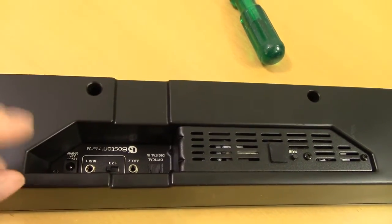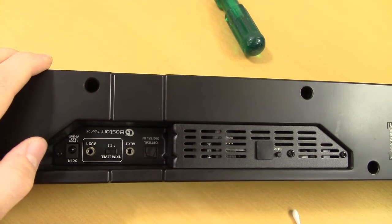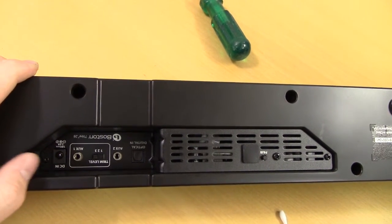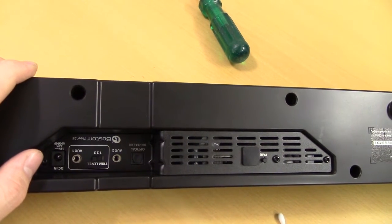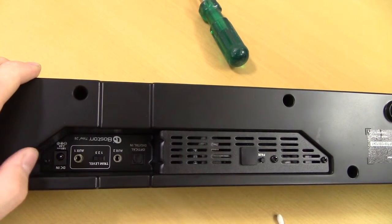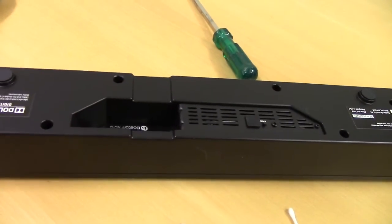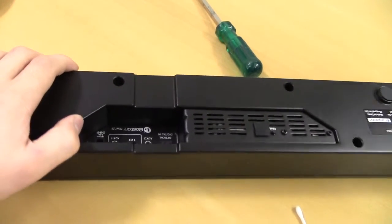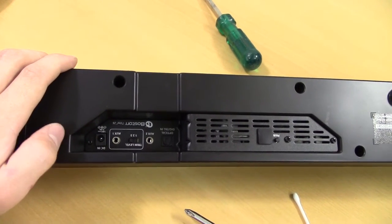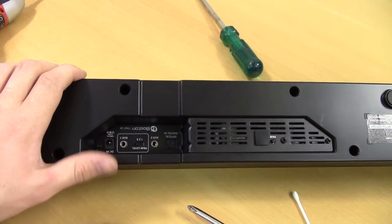Alright, I did some searching around, and it seems this thing actually has some fairly fancy switching voltage regulators in it. In particular, a Texas Instruments LM40-something, which should handle up to almost 30 volts of input. So I'm fairly confident to just hook this thing up to a laptop power supply and see if it makes any difference. I also put some isopropyl alcohol on the ribbon connector for the front panel, since that one seemed to be a bit oxidized when I took it out. So who knows, it might not even have terribly bad caps. I'm probably going to replace them anyway, but I'm going to let this thing just sit around and play for the rest of the day and see if the issue's gone away with a more powerful power supply.